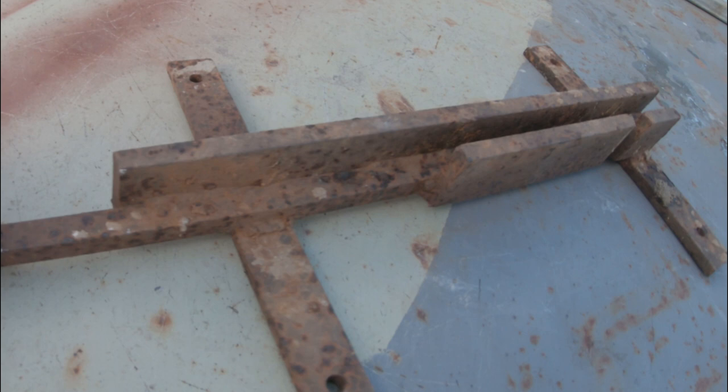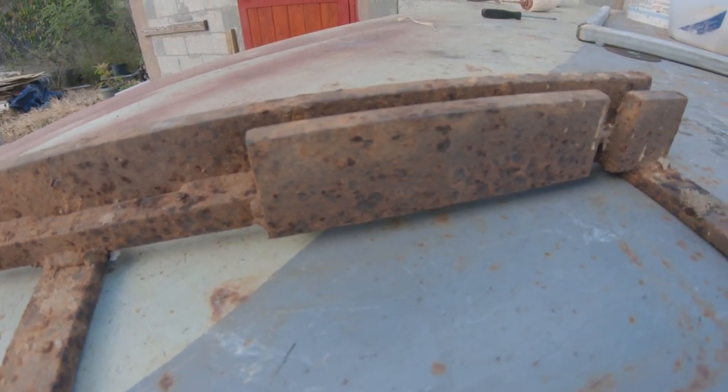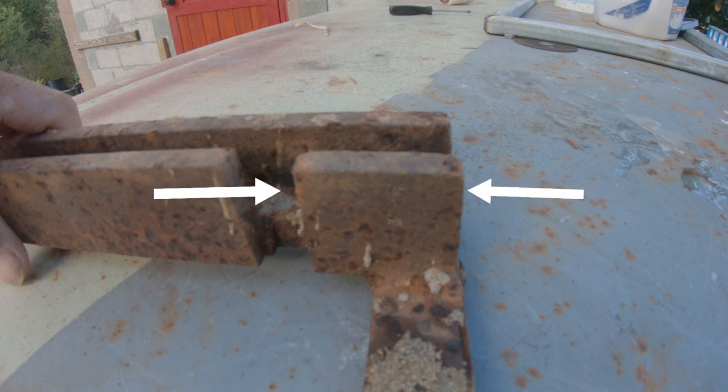It's made out of 1.5 by 1/4 inch flat bar, that steel flat bar, and a 1 by 1/4 inch flat bar, and also a 1/2 inch by 1/2 inch square bar. Okay, let's glide and take a closer view of it. You can see two pieces of flat bar to the front, and right here is a space that accommodates the 3-inch bend for the stirrup. You also have the 1/2 inch groove between both flat bars that holds the steel while you are bending it.